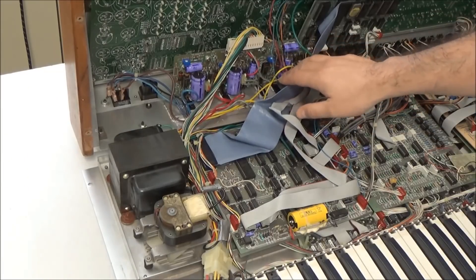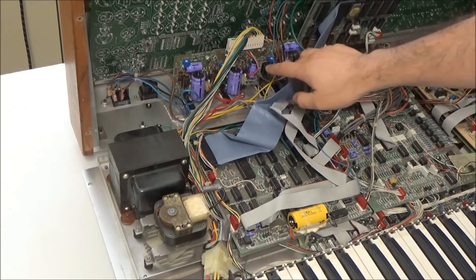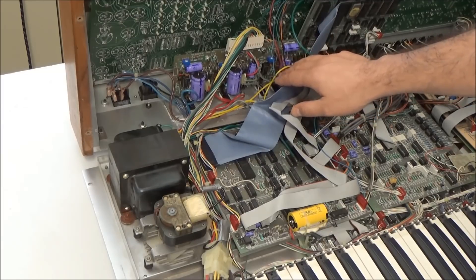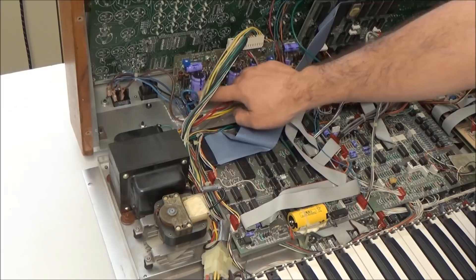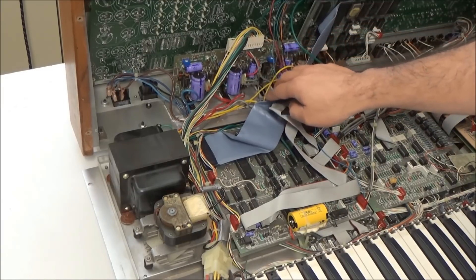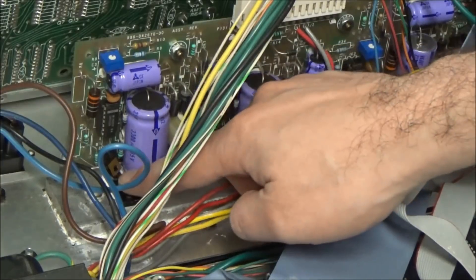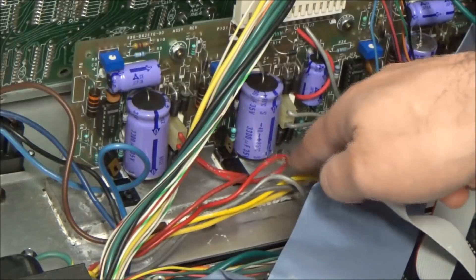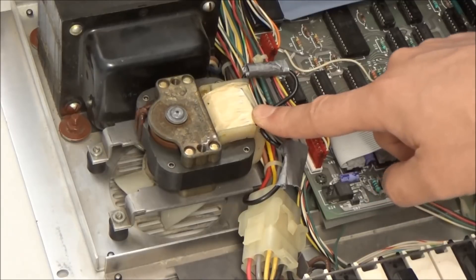Let's start back here with the weakest link of the Memory Moog, the power supply. For those of you familiar with the Poly Moog, this power supply is going to look familiar because it's the exact same supply. The power supply provides three rails: plus and minus 15 volts and plus 5 volts. Each of these rails is based around the now obsolete 723 voltage regulator, using a pass transistor to allow for a higher current than the chip itself can handle. However, the pass transistors they used are in these wimpy TO220 packages, which makes overheating a real problem. So they've attached them to this massive heat sink, and they've put a noisy fan inside the synthesizer trying to keep things running cool enough.